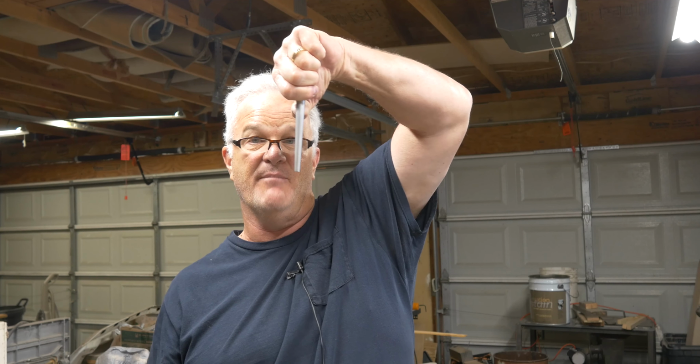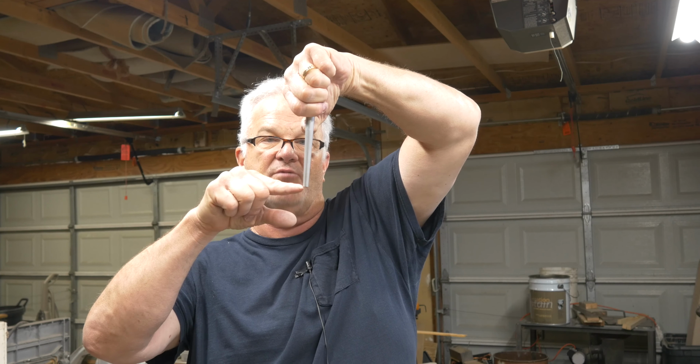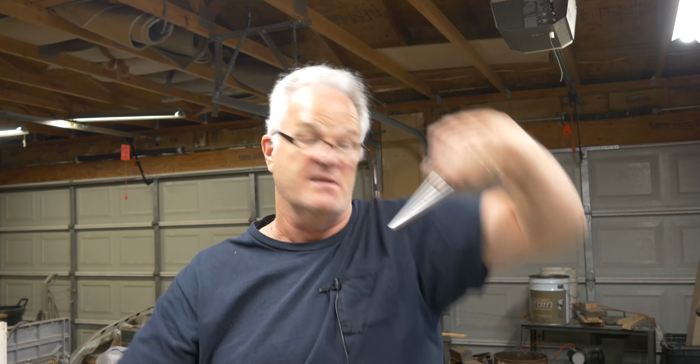we're going to show a demonstration here. I'm going to show some calculations that I did, and we're going to pour some water and look at that and everything. It's amazing to me that with my sprue, which is my cope is about that big from here to here, in this distance right here, I can achieve 1 meter per second velocity. That distance right there, that's crazy, but that's what it is.